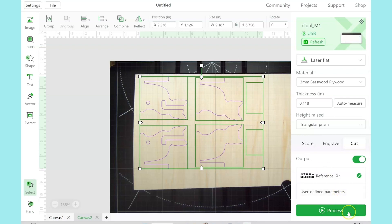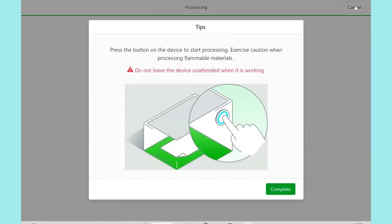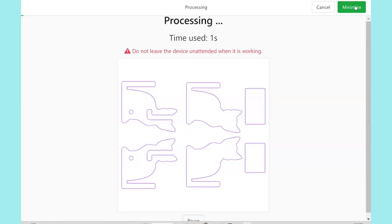And so we know exactly where this is going to cut. Click Process. It will pull up this screen. And then hit the Start button. Then you'll go push the button on the actual machine. Make sure that you have the air hose properly vented, either in their air filter machine or out your window. Then you'll get this screen here. As the machine is cutting, it's just going to count up the time. Mine took about 10 minutes, just for kind of a reference point for you. You can also click the Minimize button, and then you can continue to do other stuff on your computer while the laser is cutting.